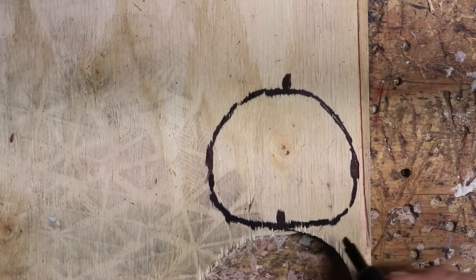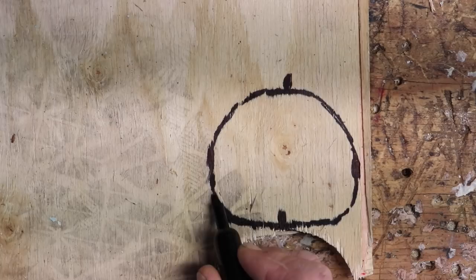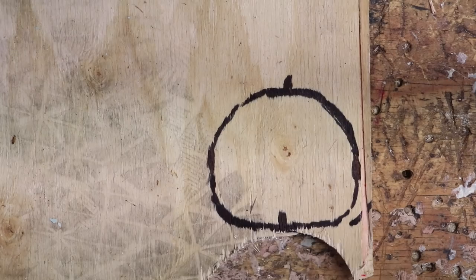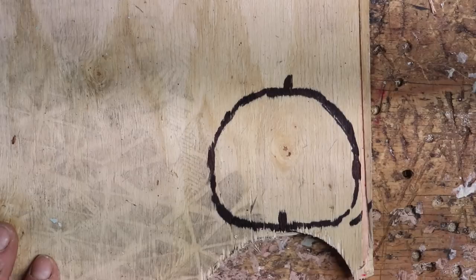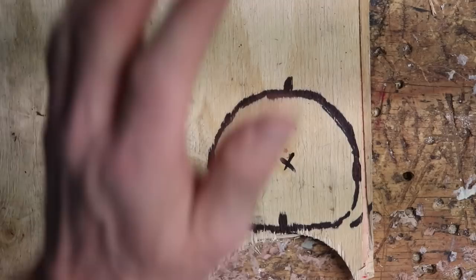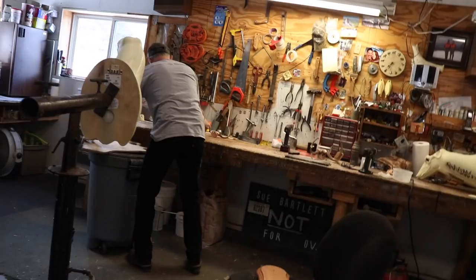I'll leave a little bit of room — if one corner is a little sharper I can add to it — then take a jigsaw and cut it out. If I've got multiples, I'll put an X on each matched pair so I know they go together and I'll do a whole bunch of them at once. The closer you saw it out the less sanding you'll need to do.